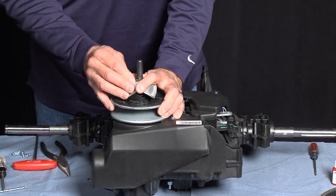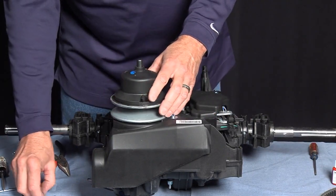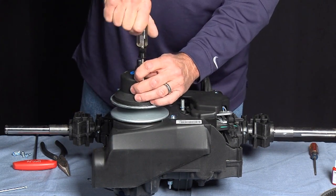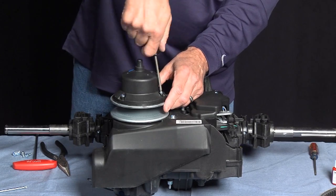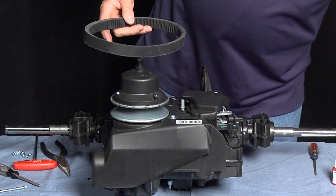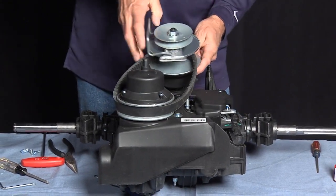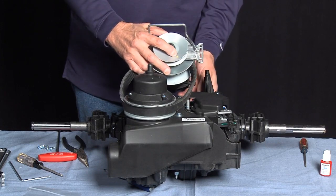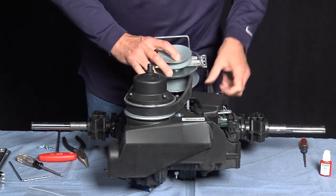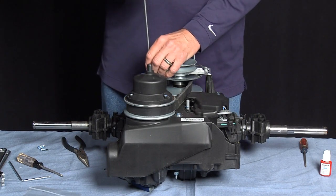At this point, we have to depress the spring, install the pin, and the cover. The three T20 screws go in next and torque to one and a half foot-pounds of pressure. Next, we'll install the belt and the drive kit, making sure that we have our belt keeper to the outside and our speed screw to the outside. Then we're going to reinstall the T25 bolts using blue Loctite and two and a half foot-pounds of torque.